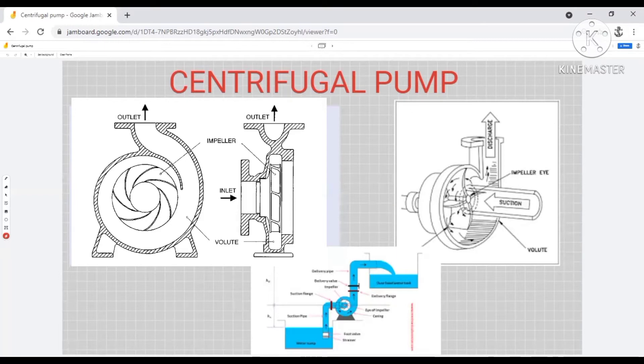So water or the liquid that is to be pumped can fill up this space. When the motor starts running and driving the impeller, the impeller imparts centrifugal force to the water present here. This space will be filled up with water. So when the impeller starts running, it will impart centrifugal force to the water, and the water will fly out radially outward, rotating with the impeller. As the water rotates, it will follow the profile of the volute casing and move to the discharge side.